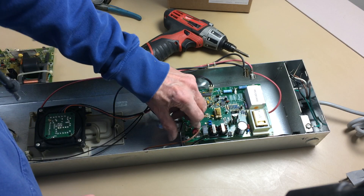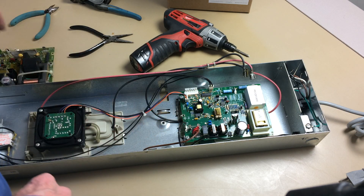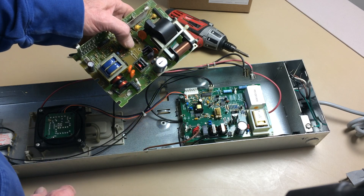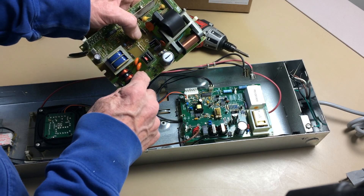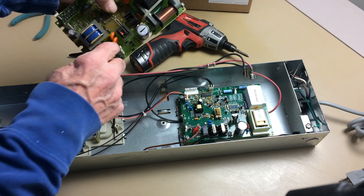These little red devices are surge protectors. If you get hit by lightning, you might see that those are blown away. Those are the surge protectors on the earlier boards. If you see the fuse blown, replacing the fuse doesn't fix the problem — that's just a fail safe.